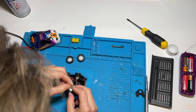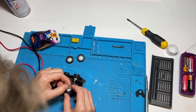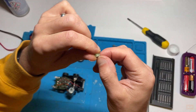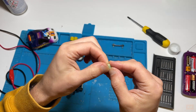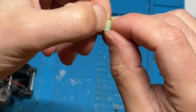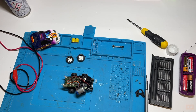It's always the way with things that have cogs - they're a nightmare for cracks. There's a cracked motor cog there, that's why it slid off so easily. It always looks like a faint black line and I could see it straight away - there's a crack right down the motor. I'll see if I've got a spare one. I'm wondering now - do I need to go in there and check all the cogs to make sure nothing else is broken, or do I just take a punt, get the battery, and then hope it works? We saw the wheels turning so the batteries are certainly an issue.